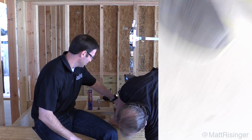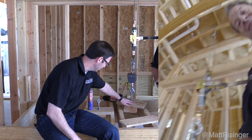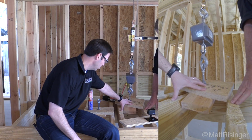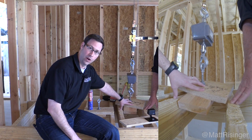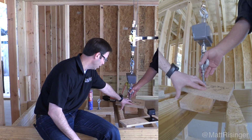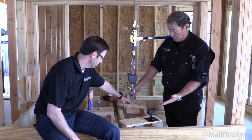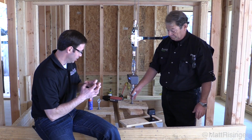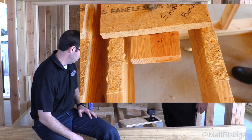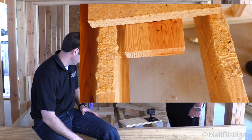I'll lace in some pictures of this, but look at this, where the SmartBond finally did release. We left a lot of plywood in place. Boy, it had bonded really well. Got a lot of wood fibers down here. I'd say that SmartBond is incredible. That is quite a test. So Advantech came loose before the glue did. Yeah, that's exactly right. The Advantech actually physically pulled apart, and a good portion of the plywood is still stuck to that 2 by 10 joist that we made there.